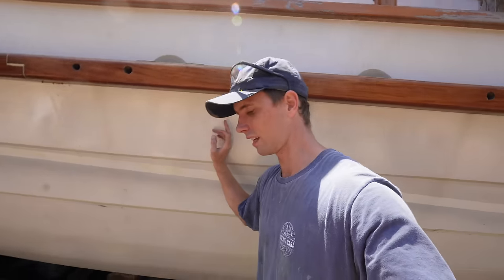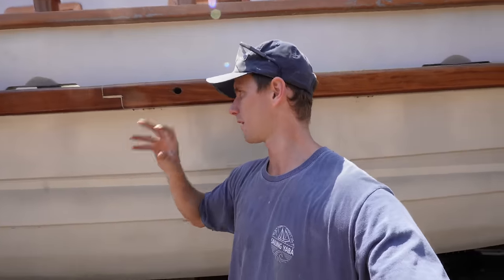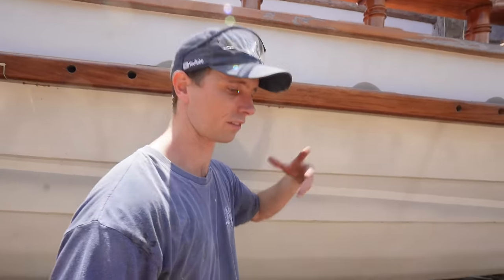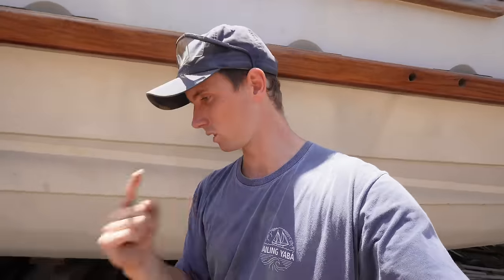This is going really nicely. It's very slow work on these first two because I've started with a technique, but now I've already figured out a way faster technique that I can do on the other six. Also the ones on there and there I can probably just do with a jigsaw and of course the drill to make it nice and clean. I'm using a drill bit with 40 grit sanding paper wrapped around it to sand and get it nice and smooth.